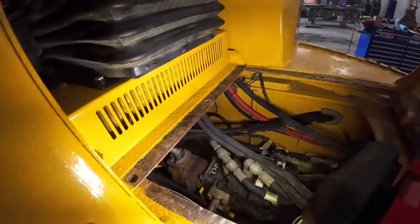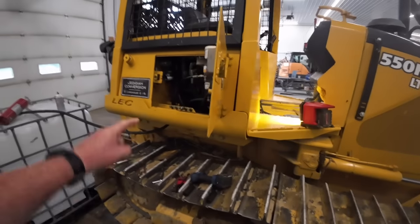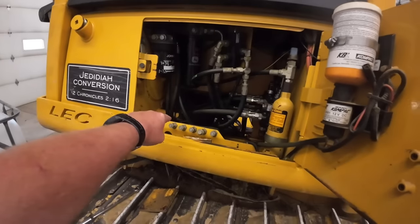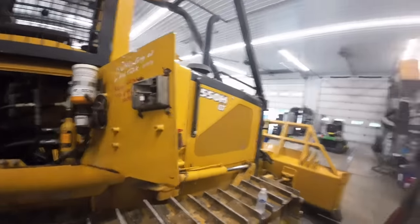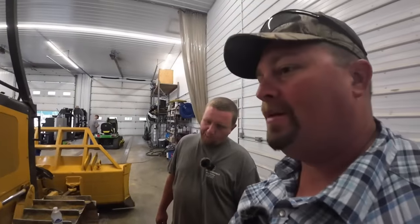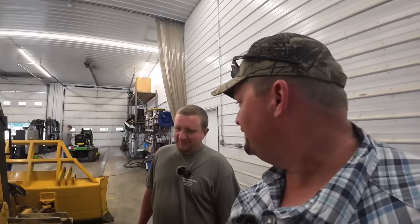Randy would be proud. So, I think first thing we need to do is actually pull that suction hose that comes off the tank right here and goes to that pump, just to verify that it's not collapsed and sucking, making that pump work hard. If it looks good, then I guess we'll pull a pump out.